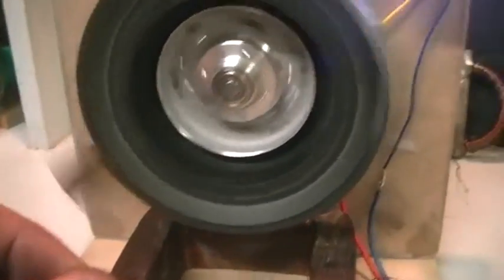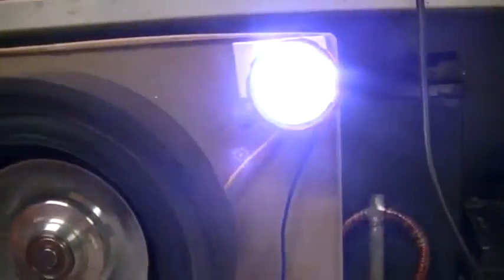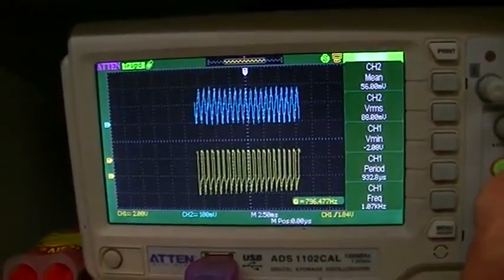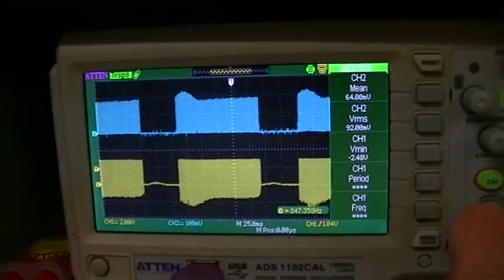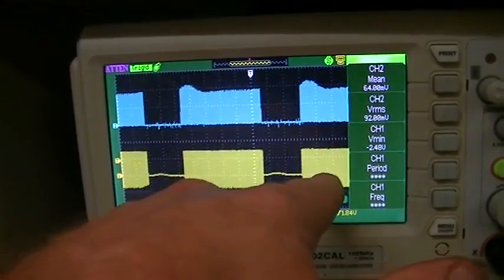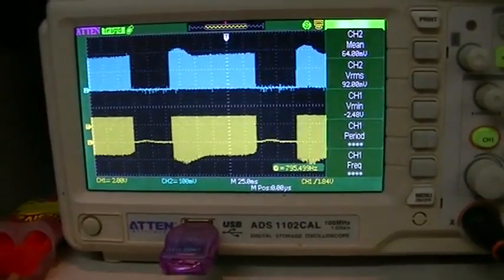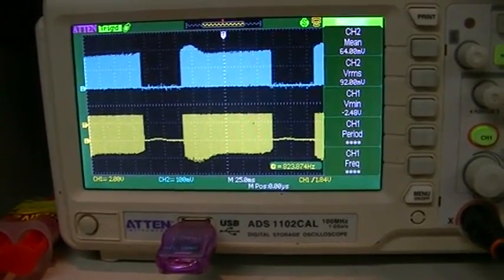Click the switch, we go back into self-oscillation, and we can turn the pot right up with the pulse motor running — you'll see we are also in self-oscillation and pulse mode at the same time. You are now seeing self-oscillation in between each pulse that the magnet induces as it passes the coil. So it's a combo of the two.